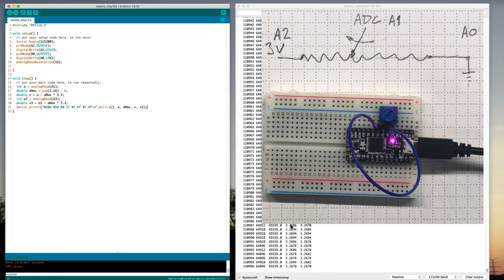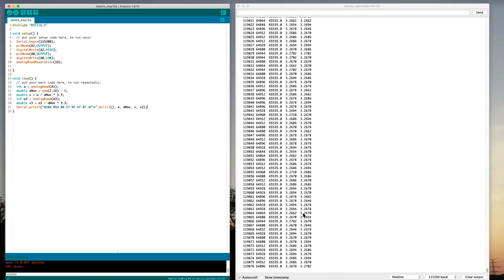It's important to note that these voltage values are all relative to ground. When we want to measure DC voltage, a lot of the time we want to measure the difference between two voltage values rather than the absolute voltage relative to a reference. So if we want to emulate a multimeter, we need to be able to measure the difference between the voltage on two different input ports — maybe A3 and A4 — and that's going to be where we go with our next exercise.